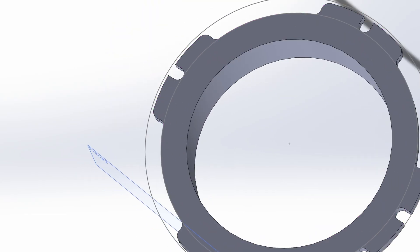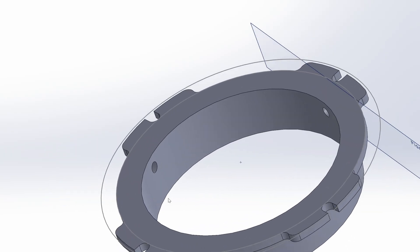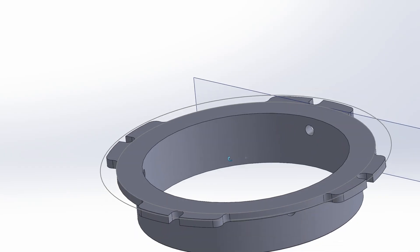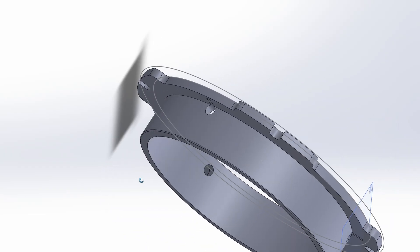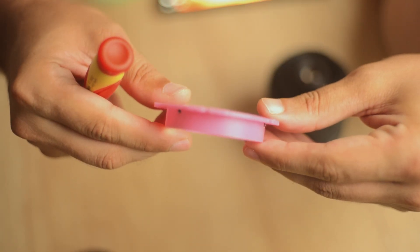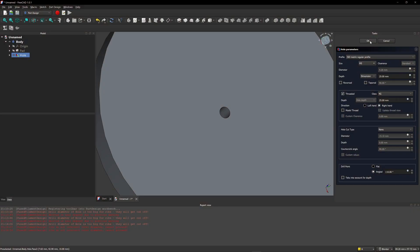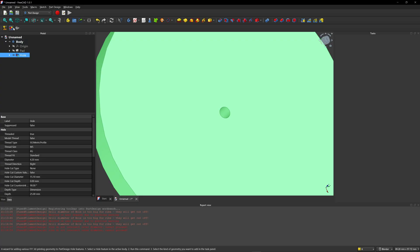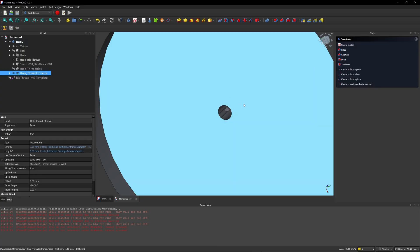I was stuck for a while when it comes to the threads of these screw holes — they are too tiny to 3D print. It may be possible with a 0.2mm nozzle, which I have, but I doubt it, plus I dislike the idea of swapping out the nozzle again. But then I simply tried making the holes a bit tighter, and tapping in the threads by simply screwing in the grub screws. This is plastic after all. There's also an option of making self-tapping holes with an add-on, but it's not really necessary in this case.